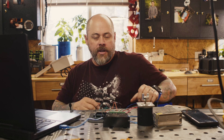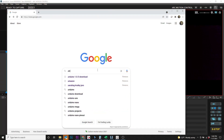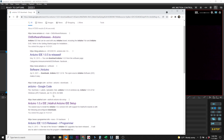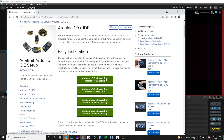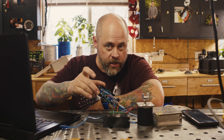Now, the next step is to upload the code to the board. If you've never worked with Arduino before, there's a program called the Arduino IDE that you use to upload software to the board over USB. Go to Google, search for Arduino IDE 1.0.5 download. I'd go to learn.adafruit.com — that should show up and give you the download options for Linux, Mac, or Windows. Install it; it takes a few minutes.